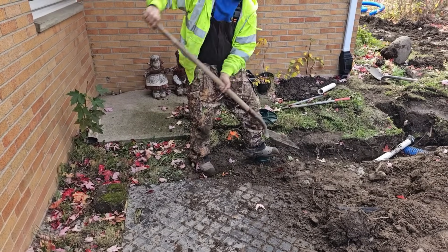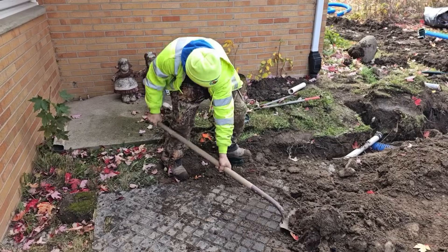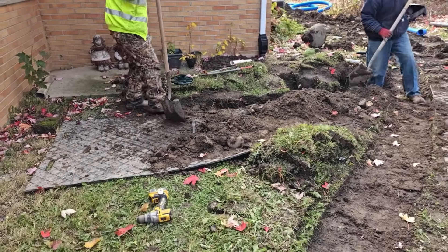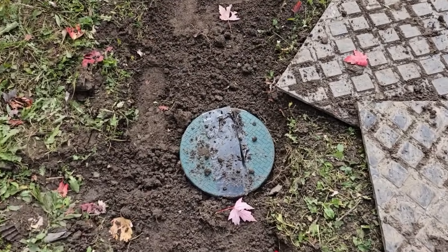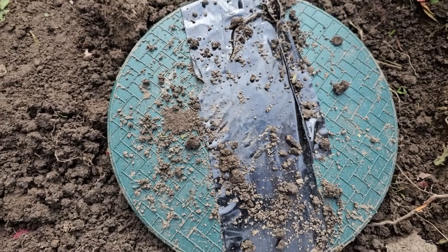The guys are setting the risers. These yard drains, because of our large sediment trap, are going to be able to catch shingle gravel as well, so the line is never going to plug. If you're backfilling and worried about dumping dirt in your grate, just put some tape over it until you're done with all your backfill.